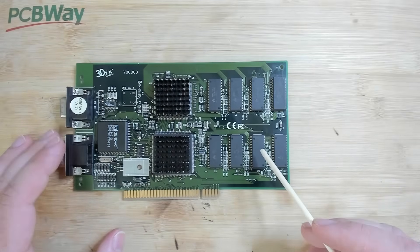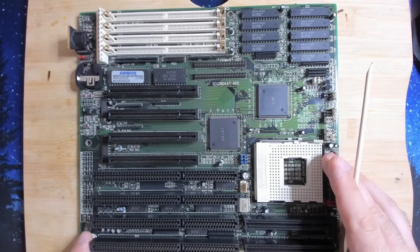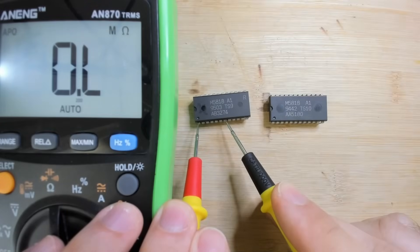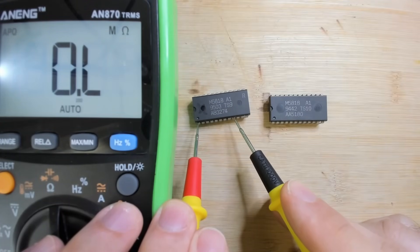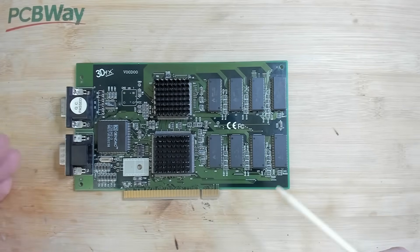What I did is try to measure the pins in reference to ground, to see if there's any difference from the other memory chips on this board. I was very successful with resistance measurement recently on the PC chips M915i fake cache chip board - by measuring two seemingly identical clock chips I could figure out the original had a reverse pinout. Before I blindly replace this memory chip, it would be a good idea to measure some pins and see if there's a difference.